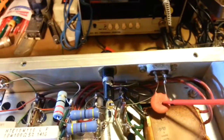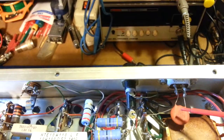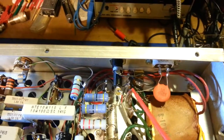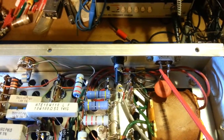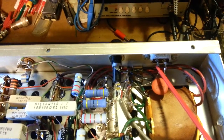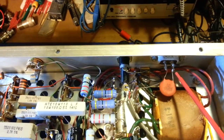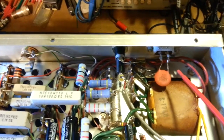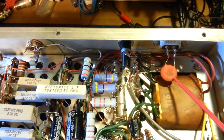So what you'd want to do is, now what I personally do is I'll actually add 3 capacitors to this. I'll add 2 line to ground, which is what this capacitor acts as. So it'll have 2 capacitors, one from here to here, one from here to here, and then I'll add a 3rd capacitor, which is an across-the-line filter cap. And your safety capacitors, I use the multi-rated, which are X1, Y2 safety-rated capacitors. Like I say, they didn't have safety-rated capacitors back then.